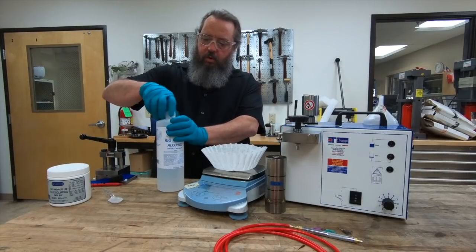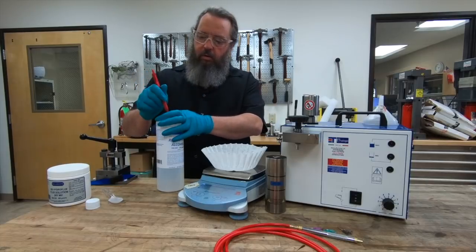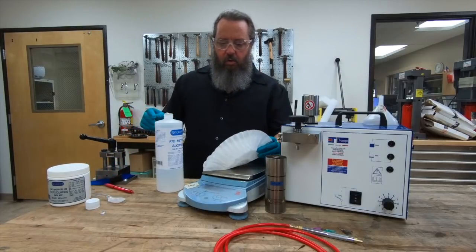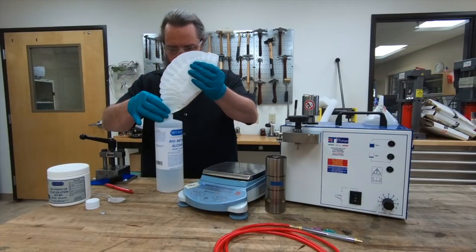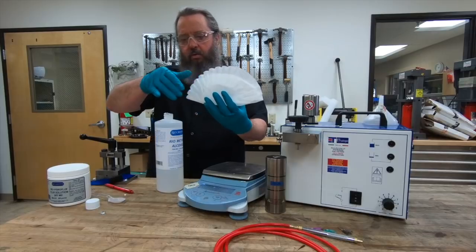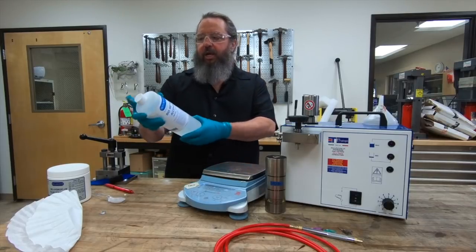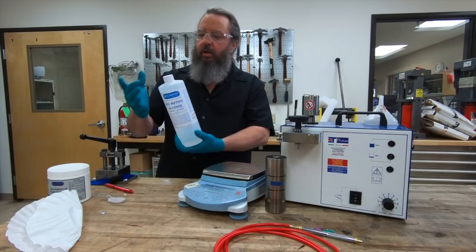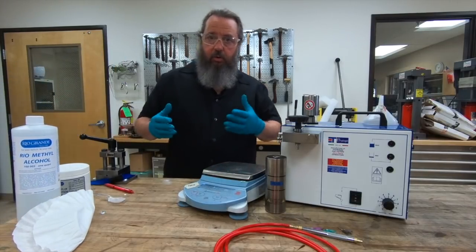Open up the methyl alcohol — there is a foil seal on it. Take a pin, pop that foil seal, and peel off the foil so that you can pour your flux dry mix directly into the bottle. Go slow and you'll get most of that flux solution into the bottle. Then cap it and give it a shake. The flux solution provides a fluxing effect to your soldering pieces and it also colors your flame, because hydrogen burns colorless.